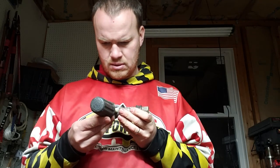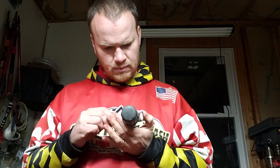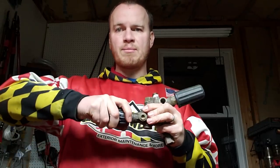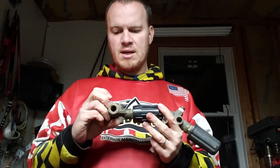This is a trap pressure unloader — I want to say this one is a Pulsar but I'm not 100% sure. Most units will probably have something more like this: the VRT3 unloader. These come pretty standard on a lot of units and are just really basic. Most times you're going to set the pressure on it initially with your correct high-pressure tip and your pressure gauge, and then just leave it alone.